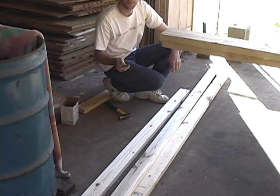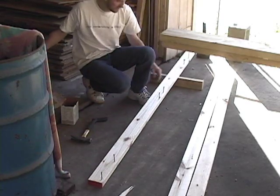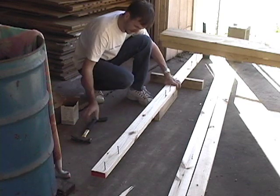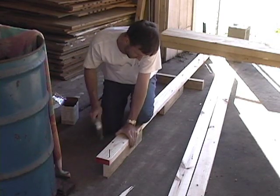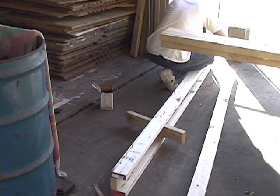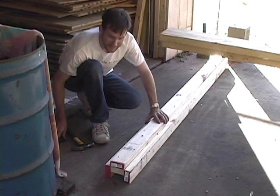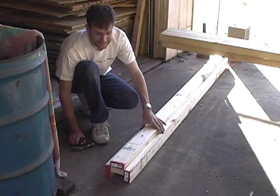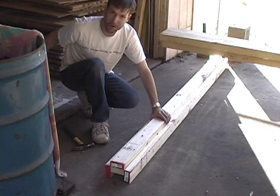I'm going to start my nails, but if you had an air nailer you wouldn't need to do that. For the T's, I found it's easier to take an extra block crossways under the board just to hold it in the right position while doing the rest of the box — keeps it from walking down and wobbling around. Start nailing again from the other side, then flip the whole thing over. Spacer blocks facing up, take the last board and nail it on top of those directly. That'll leave nailers on each side, and that top full piece you can nail sheetrock onto.